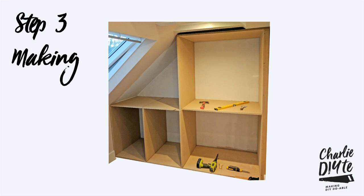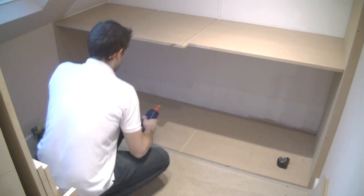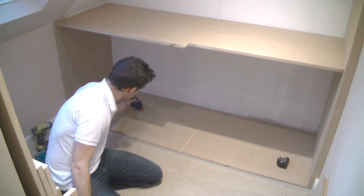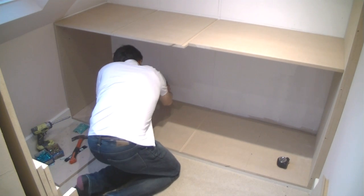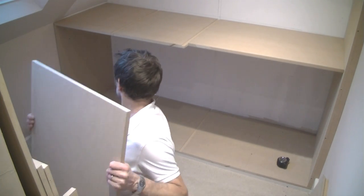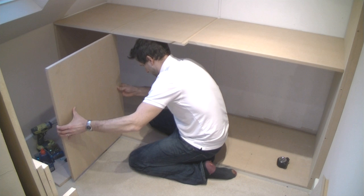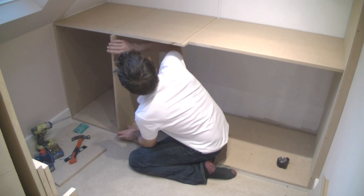With all the wood cut I can finally get around to making the actual wardrobe. Here I'm putting the 18mm sheets of MDF together. On the right-hand side I built the wardrobe slightly out from the wall because the doors needed to open without clashing with the skirting board. I've also routed some channels into the MDF — a scheme I came up with because you can't screw panels on top of each other when they're butting right up against each other. So individual panels slide into grooves cut in the MDF, which anchors them in place without the need for screws.